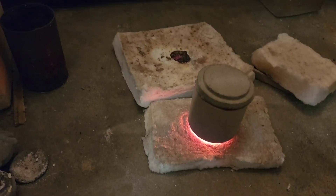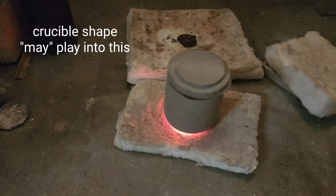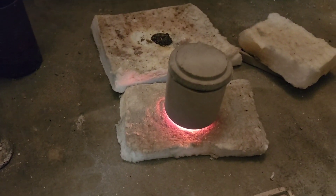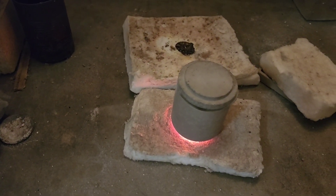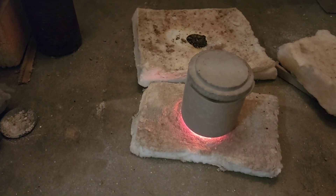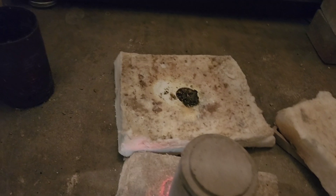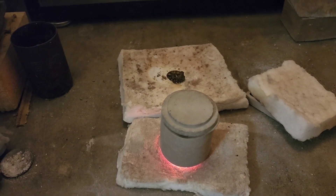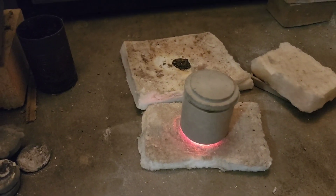It turns out things get a little spicier over here with this smaller crucible, at least in this format. I did change the refractory formula to try something else, and it definitely got hot. Normally this would heat up very gradually, but with this crucible that is not the case. It's well over a thousand degrees and it put a very big char mark on my wool blanket. Lesson learned — that was about 30 minutes in the microwave at 50% power level. Definitely not what was expected.